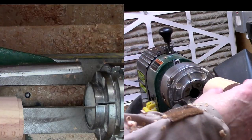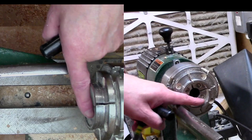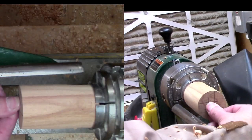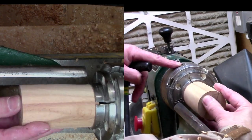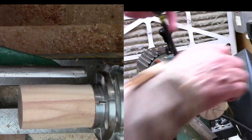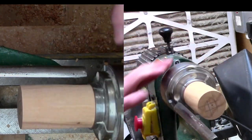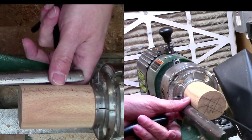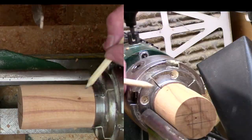The next stage is just to put it into a chuck. Make sure your jaws are fairly clean. These jaws have a little lip which pulls the wood into the chuck. Just put your thumb on the end, turn it round so we've got the key point there, and just tighten it hand tight — go to the other one, hand tight again. That is now secure in the chuck; it should run pretty true. With the lathe switched off, we can just spin it round and we can see it's virtually running true. We're going to part it off.